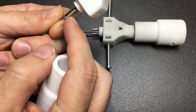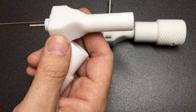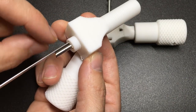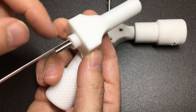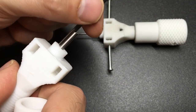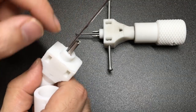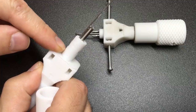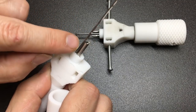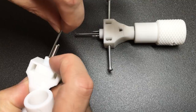If we extend this piece of metal tubing out — still providing the structural element it needs — all the way down for the ejector pin picking tip to extend through, we could move these tension tips in a little bit closer. There's a tiny gap between the tube and the tensioner — we could move that to touch it, and file down the edges of the tube just to extend down into the tip so that they press together very closely.